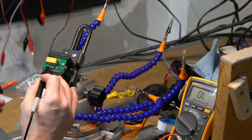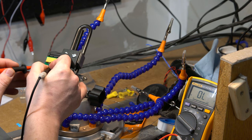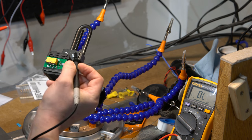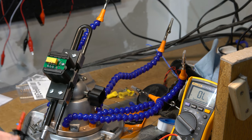Yeah, so the first one is your entry point, if I remember right. Each side just has a different switching mechanism, but the first one here is normally closed like this, and if you switch it, this back one would be open, but I don't have 9 volts to switch it. So that's pretty much how a relay works, and it's a double pole, double throw, so when you flip this, both sides switch back and forth.